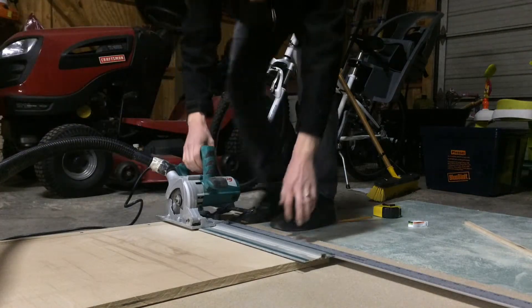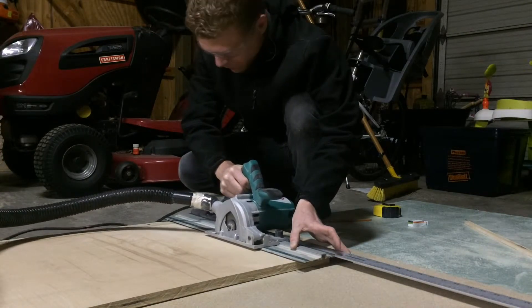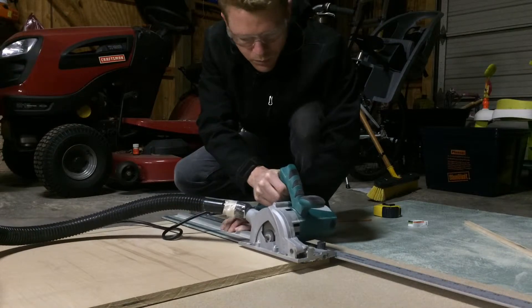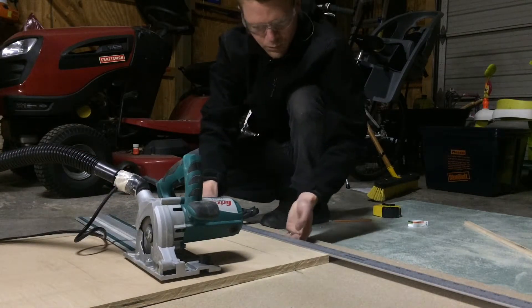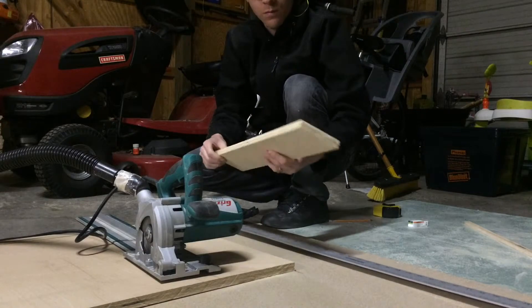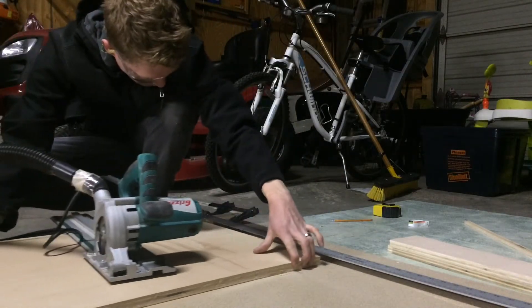The track would line up with the side of the ruler, so I could do repetitive cuts and mark out measurements quickly — for instance, cutting all the pieces for the drawers. This video shows me going through making some of the drawer sides, pieces that were identical. A table saw would have been much faster, but the good thing about the track saw is you can lay the piece of wood on the floor on top of a piece of foam, and the blade just barely goes through into the foam. You don't need to handle big pieces on a table saw, and there's really no danger — no way you could get your finger cut off. The blade is fully enclosed, and there's no kickback like there might be on a table saw.